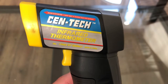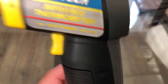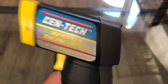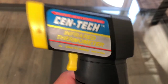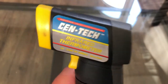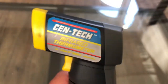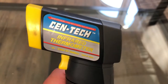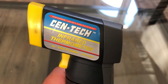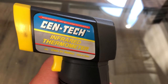The usage I have for this is specifically for RC purposes — to monitor my motor temps and my electronic speed controller temperatures. Your ESC, which is short for electronic speed controller, and your brushless or brushed motor, whatever system you're running, you need to monitor your temps. Otherwise you're going to basically cook, fry, or catch your ESC on fire — or smoke it mainly — because your ESC pretty much controls the voltage being put through your RC car.